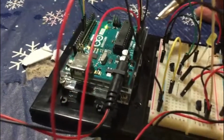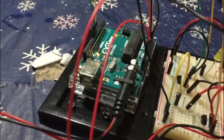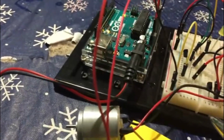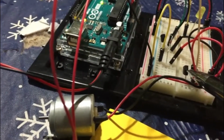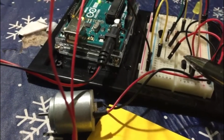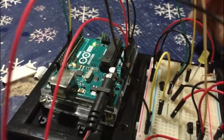Good morning. Hi. And then over here is like a microprocessor, like a miniature computer. And on my computer or any kind of device, you can write the code to give it directions. So what I did is I wrote code for this processor to say, I want you to read this temperature. There's a little temperature sensor, and you get to set the value. I set the value at 56 degrees Fahrenheit. When it gets above 56 degrees Fahrenheit, it goes to the input. So there's the input, the white wire is the input.